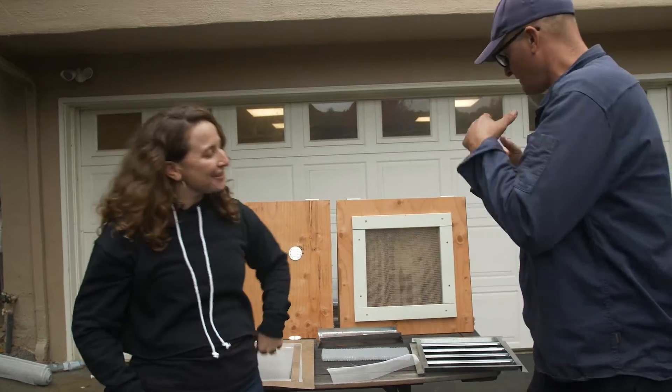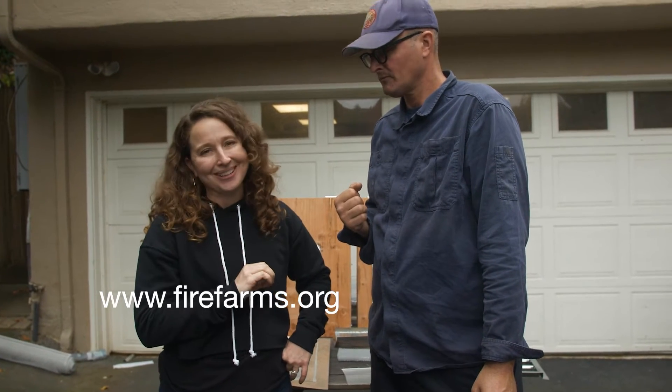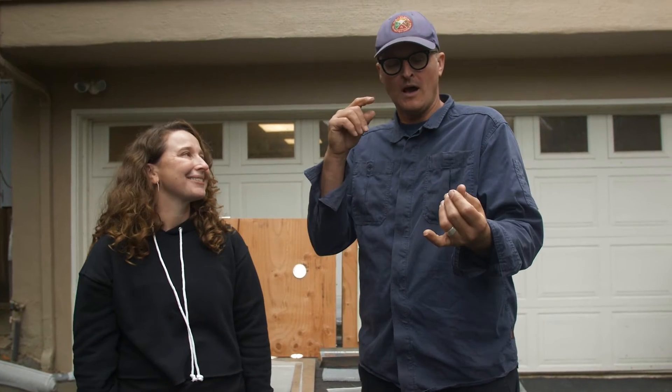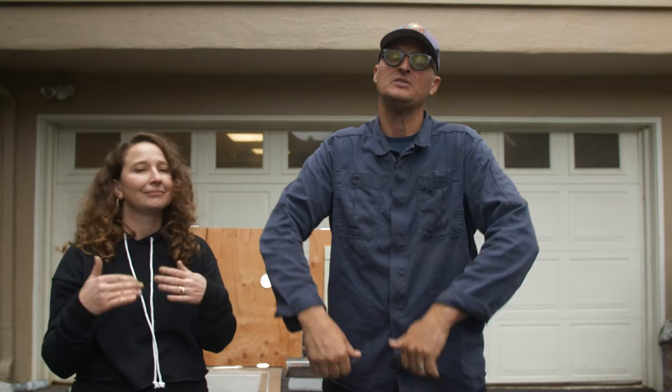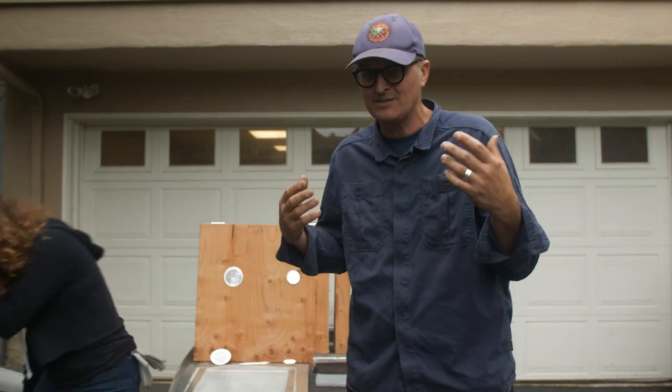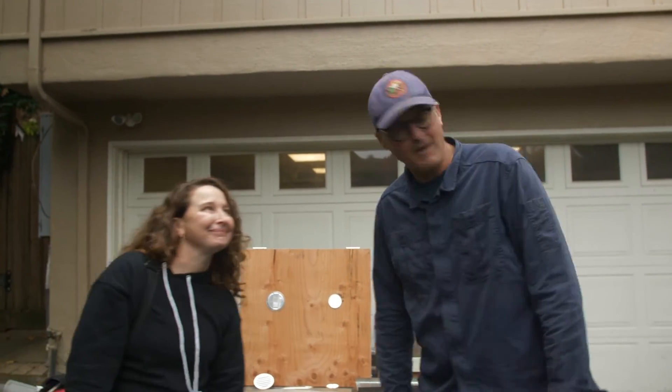Thank you very much for doing the work. Where do people find you? We have a website: www.firefarms.org. Or you can find us through Fire Safe Marin. Kazoo, it's been really fun to work with you. Sixteenth inch is best for keeping embers out of your basement and your attic. Eighth inch is pretty good, and it's the code — but change it. It's wintertime, and it's a great time to harden your house. Start the process. You saw how easy it was to change a vent. You change the vents, then you start working on the other stuff. Let's get to work!